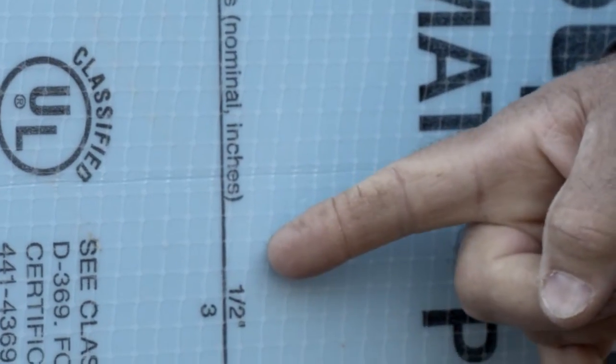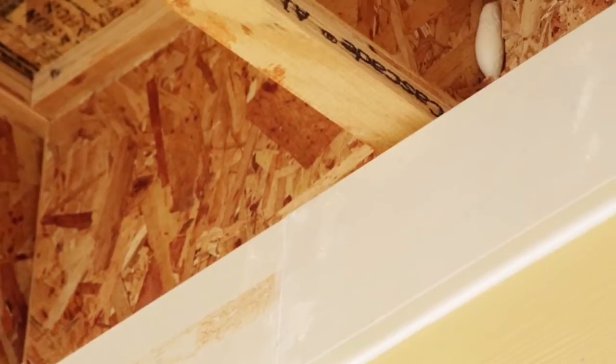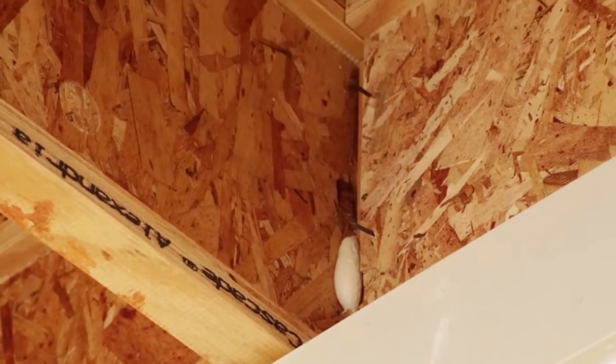Mike, I know a little bit about R-value but tell the people at home what R-value means. Yeah, real simply, R-value is the heat resistance through this wall cavity — so the higher the R-value, the more energy efficient this wall cavity will be. This half inch piece of rigid foam has an R-value of three, giving that continuous air barrier, unlike Tyvek which has no R-value.